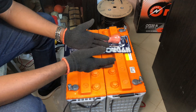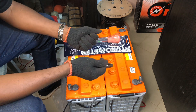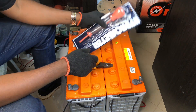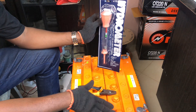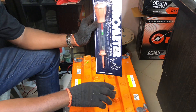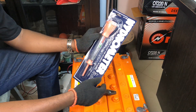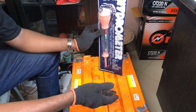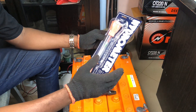For tubular batteries, you can change the electrolytes and top them up with distilled water depending on the efficacy of the electrolyte in your battery. We got this hydrometer specifically for this class to carry out this practical. For those of you using dry cell batteries or lithium-ion batteries, unfortunately you cannot use a hydrometer — you have digital meters you connect to the terminals to test the battery.